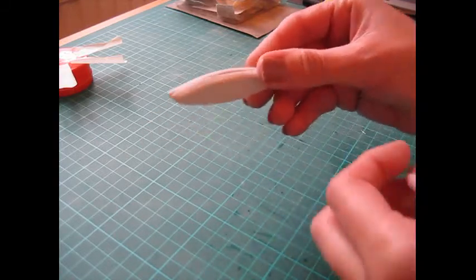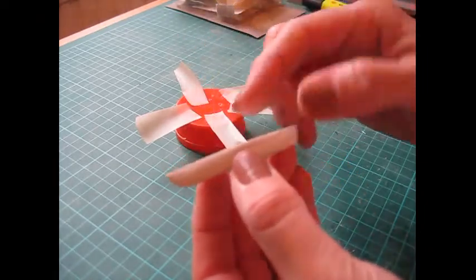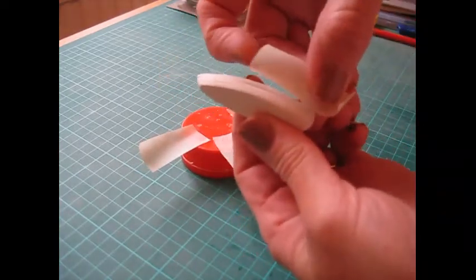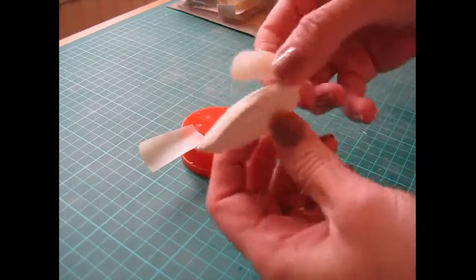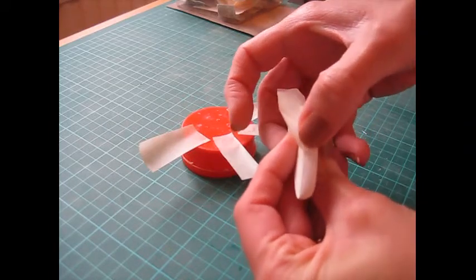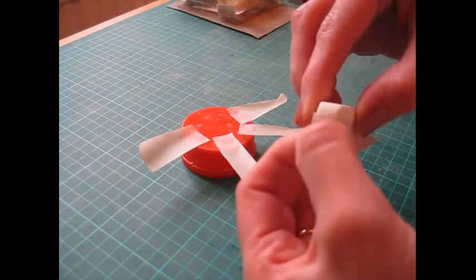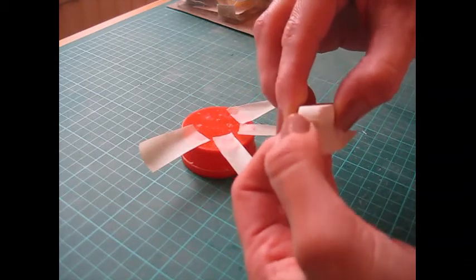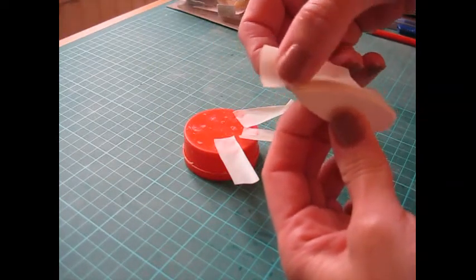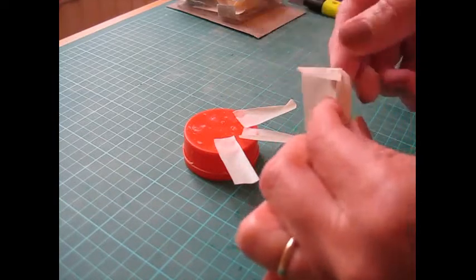I've painted the boat all white and sanded it with a soft grade sandpaper. Now I want to paint the bottom half blue. Because I'm not the neatest painter, I'm going to mask off the top section — the deck and the top layer of wood. I've cut some strips of masking tape and I'm just applying them around the edge along that top line, pressing the tape down with my nails to make sure it's completely in place and following the line around the back edge.